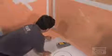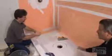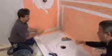This might be important because typically the tile size we put on the shower pan is smaller than what we use on the wall. It's going to be affected by any extra buildup because of the small-notch trowel we'd use to set that tile. So we're going to continue on.